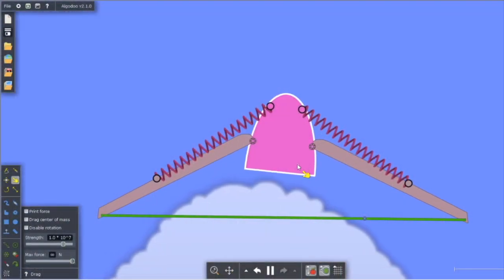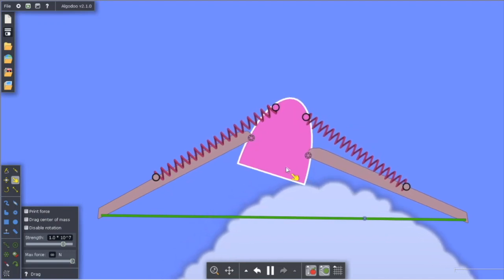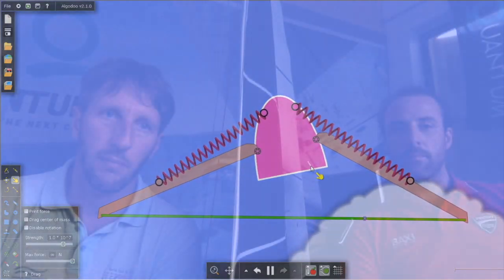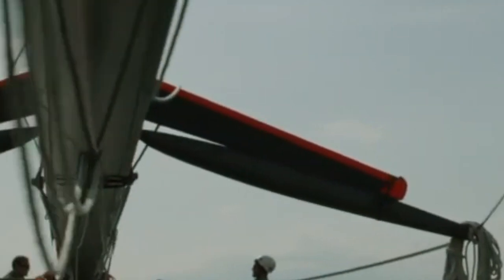This is not easy to achieve, but with probably some active mechanism and some passive guides to make this movement precisely controlled, they can achieve the correct tension on each side. The elements of this system are a boomerang in front, as you can see, and the actual spreaders are made up of a bar fixed to the middle of the side of the mast with another ball system, so they can basically move in whatever direction they like. In the end we can think about movement up and down, apart from the one that is guaranteed — the forward-aft movement following the rotation of the mast.